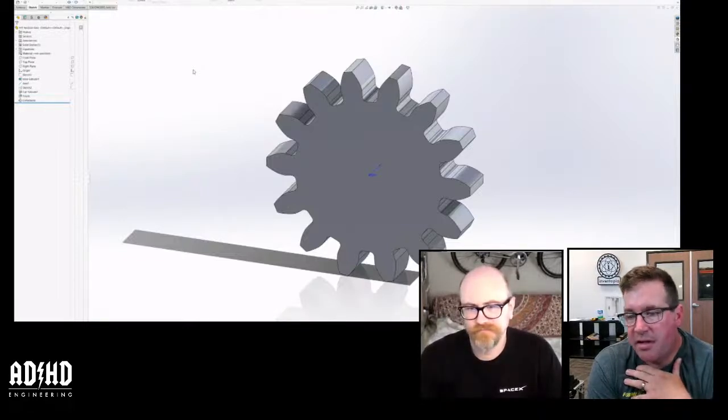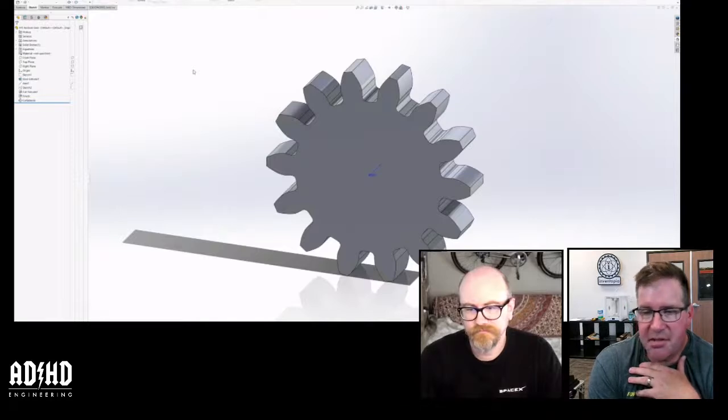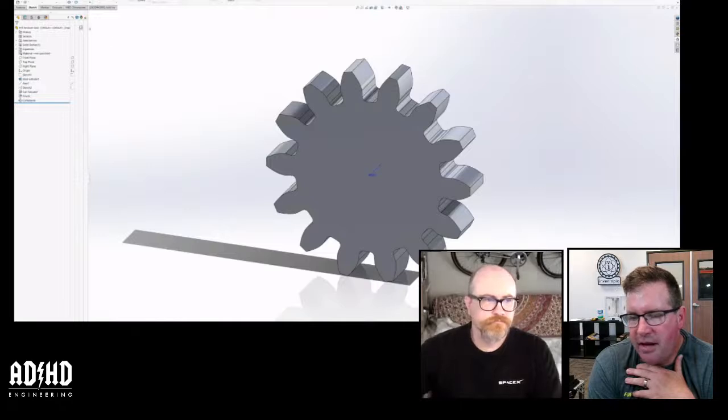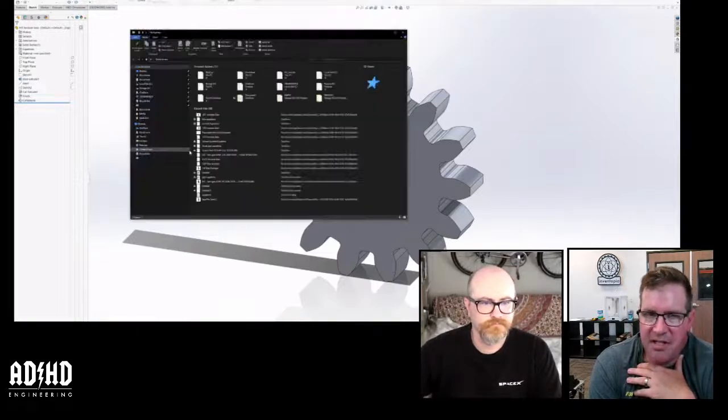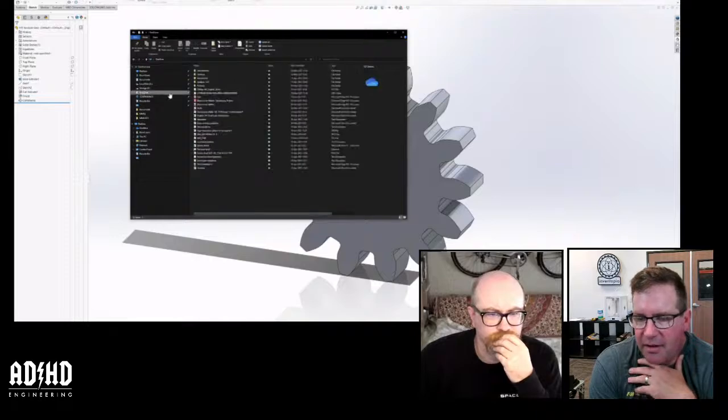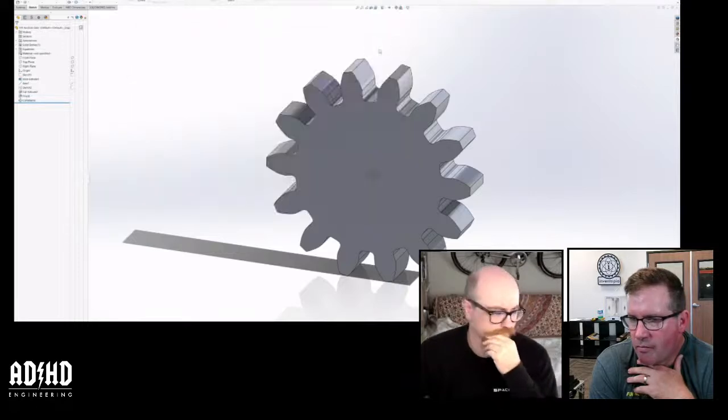There are all these things like we want the gears to mesh appropriately, right? Which means that the sketches need to be driven by math rather than a bunch of small arc segments. And if you're going to say, hey, these things need 5 thou of clearance between them so they can be fitted together, I don't think Martin has ever put a clearance tolerance into a part.